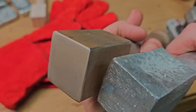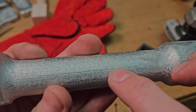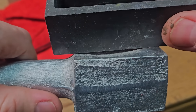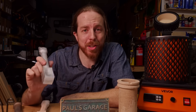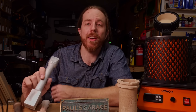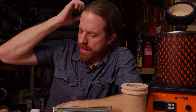After a quick angle grinding, you can see the terrible shrinkage on the square end, and even a little bit on the pointy end. Honestly I rushed this whole casting process, but the surface finish isn't too bad. You can see the layer lines from the printed pattern, even where the nozzle tracked back and forth on the top, but that shrinkage is hideous. Will this work as a sand rammer? Absolutely yes, it'll probably work just fine — but I'm not content with 'just fine.' I want it to look really good straight out of the sand, and this does not. Shrinkage is a no-no. It doesn't just make it look deflated and sad, but it can cause voids and other structural defects. It's a great learning tool though, and also probably a great sand ramming tool for when I inevitably lose the other one.